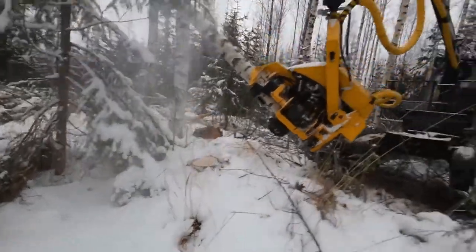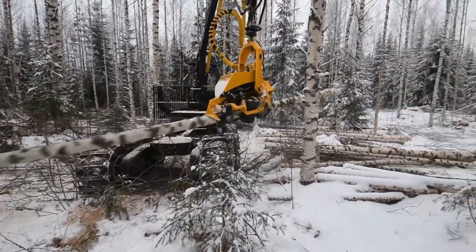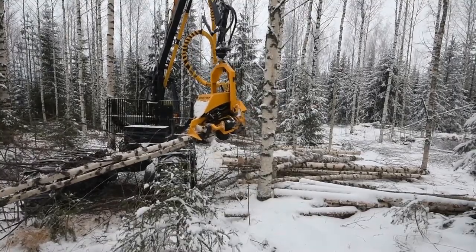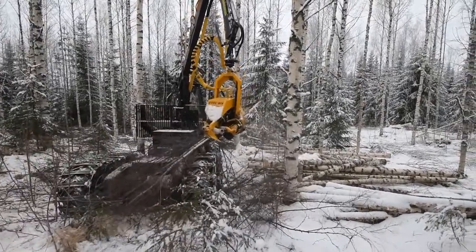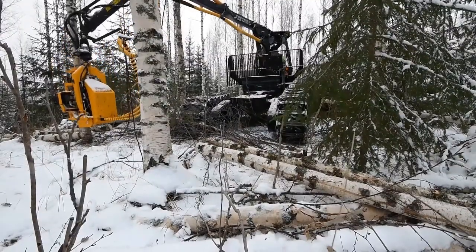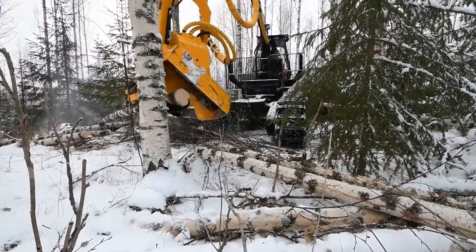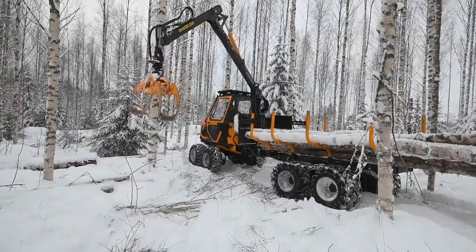Kinetic K437. The small forest machine was designed in Finland, suitable for sparse forests. Weight 3,500 kilograms. Load capacity 4,000 kilograms. Width 1.92 m. Engine Yanmar 36 horsepower. Crane Country 550 master, reach 5.5 m. Grapple 0.17. Warm cabin. Dual drive devices. Grammer fabric seat. Valve 2/9 on OFF with all functions in handles including support legs. Tires 31x15.50-15, width 38 cm, height 78 cm.